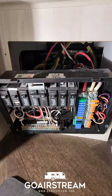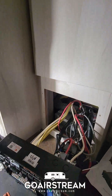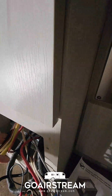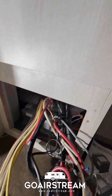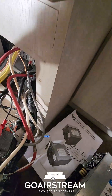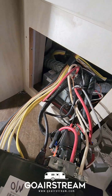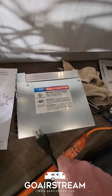On the 27 FB, access to the converter is behind the breaker panel under the pantry. The nice thing is there is enough wire length that I can get everything out of the way without disconnecting any of it. I should be able to get the unit out without having to disconnect any wires, though you may have to remove some — just make sure you mark them if you do.